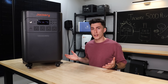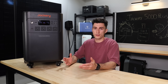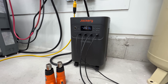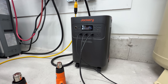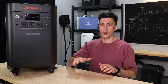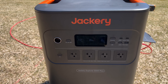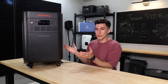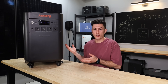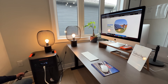The unit advertises a 14,000 watt surge, but we didn't see that. Our air conditioner is about 10,000 watts surge to get it running, and this couldn't start that. However, it could run close to that for quite a while — we ran a 9,500 watt load for about 20 seconds and an 8,000 watt load for about 30 seconds, which is cool. For surges under 10,000 watts, it has the capacity to get things going without just surging quickly and shutting off. The 14,000 watt number was a little shy. Otherwise, all of our testing went really well. The solar input is great. Idle consumption is about 58 watts per hour just idling — it's a 240 volt unit — and it'll run about three and a half days if you just turn on the AC plugs and let them go. That's still better than something like the F3800, which was about 80 watts. The UPS function works great — if you have a load running and the power goes out, it'll keep that load running and you won't even notice it happened.